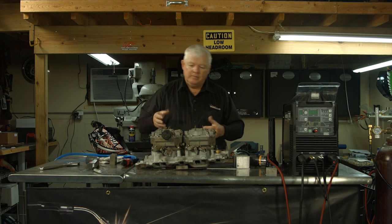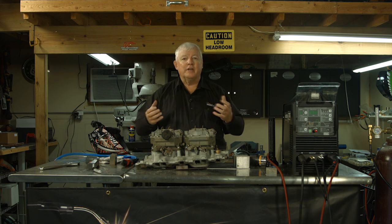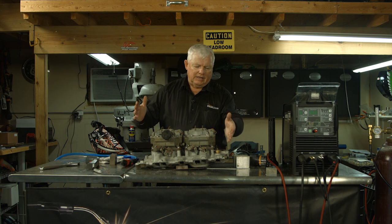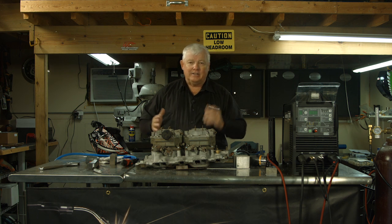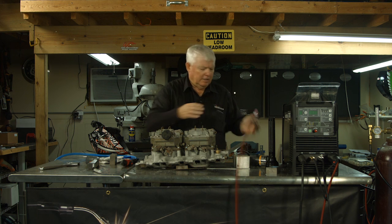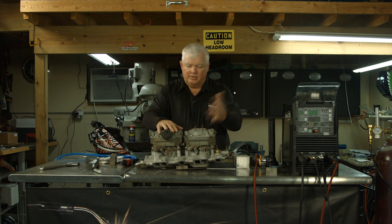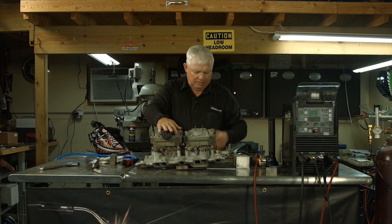It's amazing how it will level out. I did three different repairs on here. The first repair, the oxide was so thick you could hear it — just hear everything trying to break through and create continuity. The second and third welds actually smoothed down pretty well. All I did was grind it out, get down to bare material, and use 4043 filler. You can change your machine settings according to how much cleaning action you need, but you've got to get the oxide off. I probably used no more than 150 amps — that's what I set on the machine — and this is a 150-amp torch. Did it get warm? Yeah, I could still hold it. Even though welding at melting temperatures around 1,200 degrees, I was touching the carburetors and they never saw any open flame or any major heat. We're going to take this back to the owner and see if he can use it.